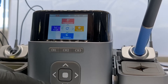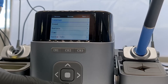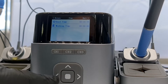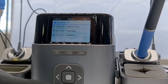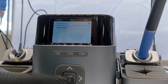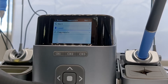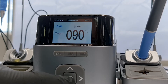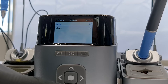We'll give you a quick rundown of the menu. We can open it up by clicking the middle button. The language is conveniently placed as the first option in the menu. We can turn off the sound feedback under the sound settings. Configure your time settings under the time tab. Under the restore section in the settings menu you can quickly restore all the different settings of the device — if you ever mess something up you can just go back to this window. Next we have the temperature tab in the main menu, where you can configure the temperature unit. Under the level option you can set up the different channels' preset temperatures. The compensate setting becomes interesting once you have to recalibrate your station — we will do a separate video on this in the future. At the bottom of the main menu we have the dormancy option, where we can configure the dormant temperature. The default value is 90 degrees Celsius and the default delay for when the soldering station goes dormant is 10 seconds.